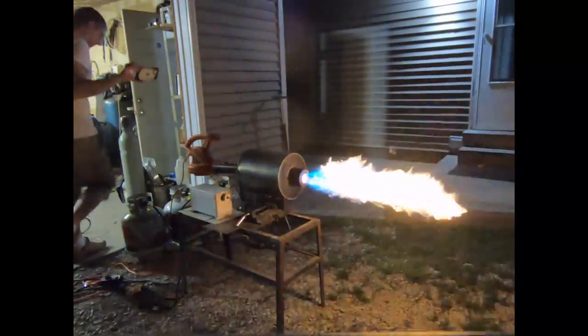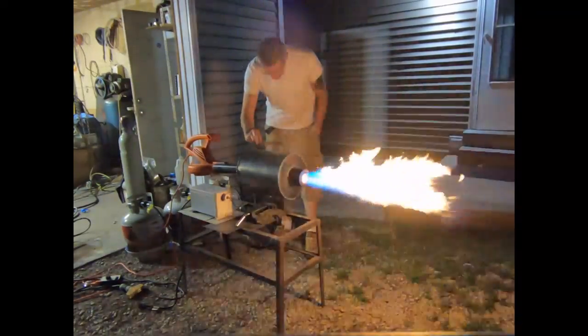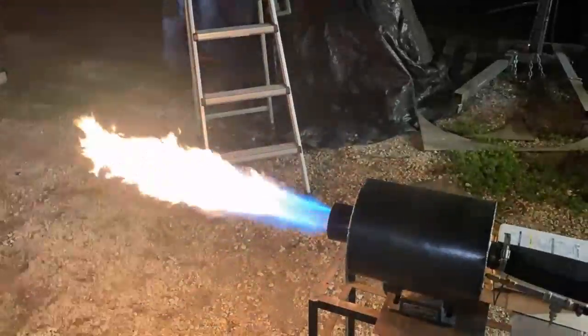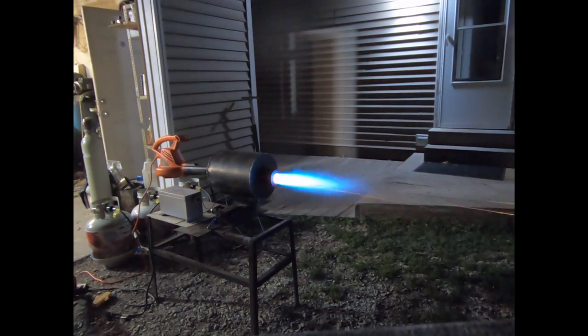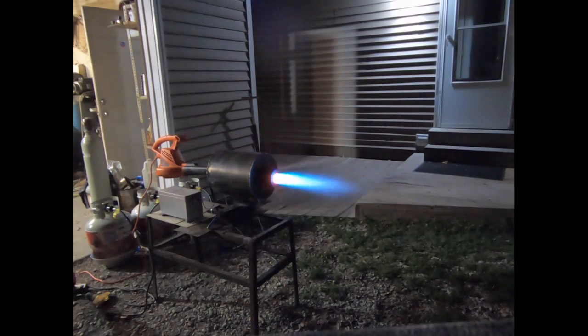This is just to teach me how to build the actual furnace burner. We're right around that 2 psi range, and this gauge is sensitive enough to show us that when the blower is on full power we get a half pound of back pressure — so we're losing half a psi. If you have a 2 psi line and hook a spud up to it, you're not going to get 2 psi of flow when you open that valve all the way; it's going to drop significantly. I may only have about 1 psi of actual flow to work with.